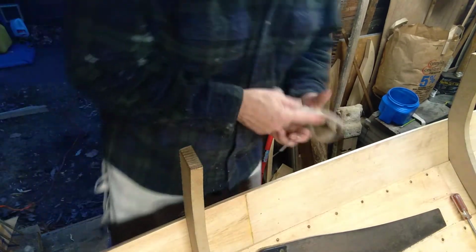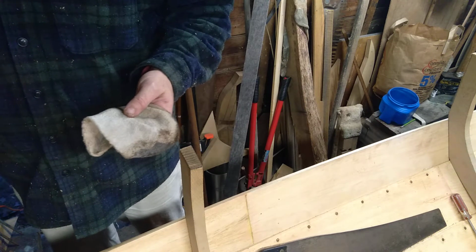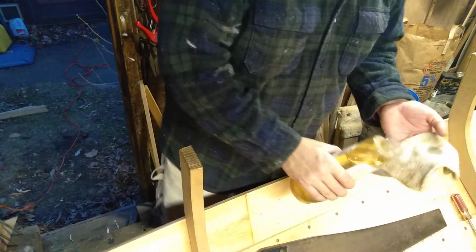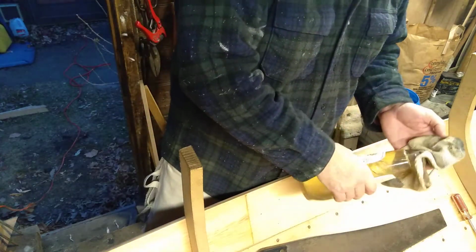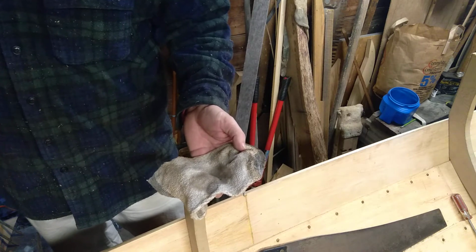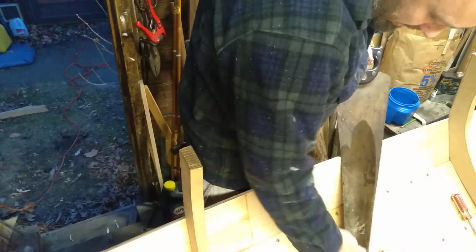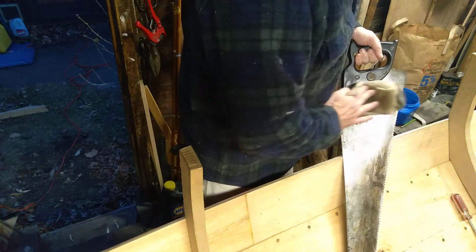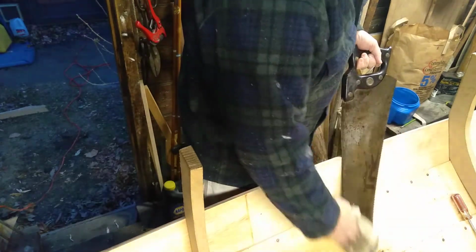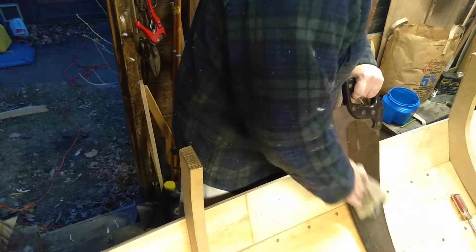Alright, so I've only got one frame left to cut, but figured I'd take the time to use this little trick. The saw was squeaking and complaining a little bit on the last cut, so I'm using a lamp oil from Lamplight Farms. It's part paraffin and part kerosene, but you can use just straight kerosene too if you like, and probably liquid paraffin on its own would work